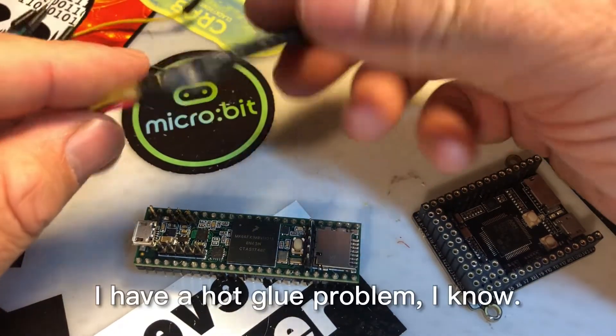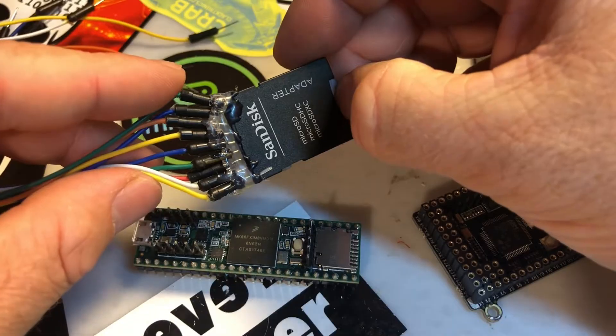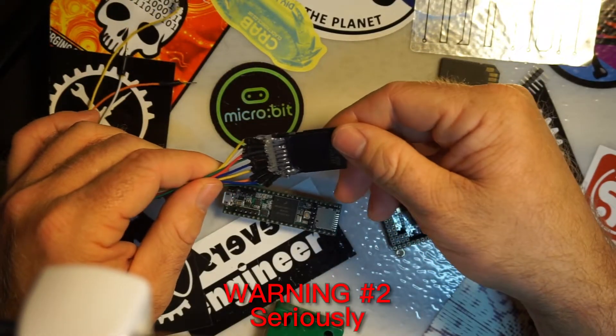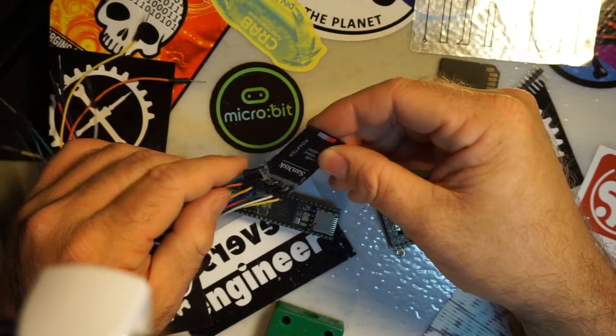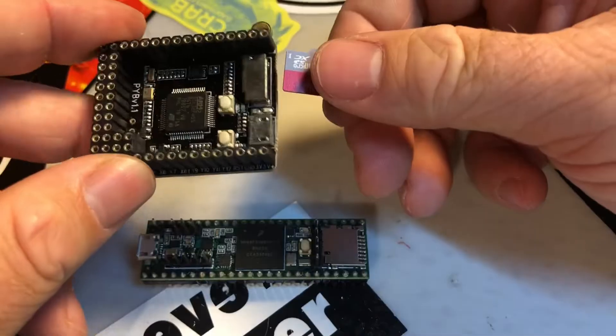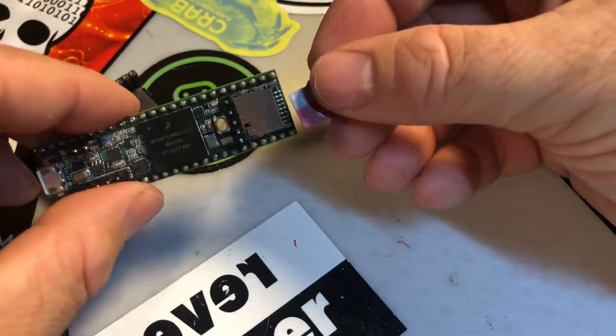You can see that I made this one for testing out of crappy jumpers. I didn't actually end up needing all of these wires, which you'll see later. But it works just fine, as long as you're careful about only giving these 3.3 volts for power and for logic. And of course, these aren't ESP8266s, but you will find boards that have their own SD card slots built in, like this Python board here and this Teensy.